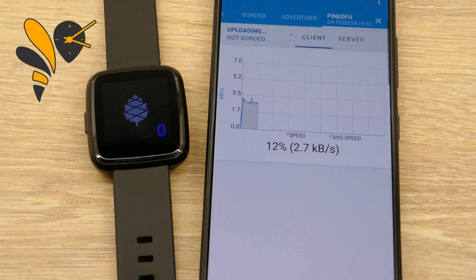So I have one called reloader.mcuboot.zip, which is how you switch over to the wasp bootloader. All the binaries I've shown you today are on the wasp-os continuous integration builds. So if you go to the wasp-os GitHub, click on Actions, you'll go to the artifacts, and in there you will find all the binaries that I've been using to copy things across: reloader.mcuboot.zip, micropython.zip, and reloader-factory.zip. So this one I'm showing you now is reloader-factory.zip. It's putting the factory firmware back. Again, it's a relatively slow process. I will speak to you when we're nearly done.